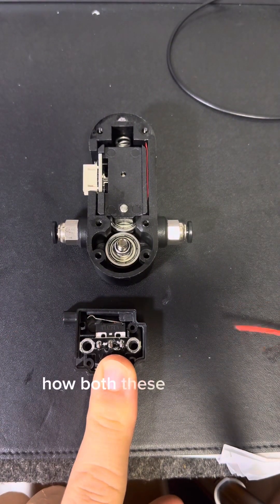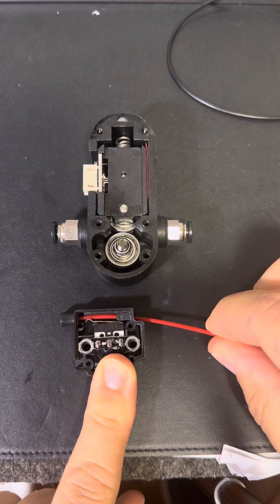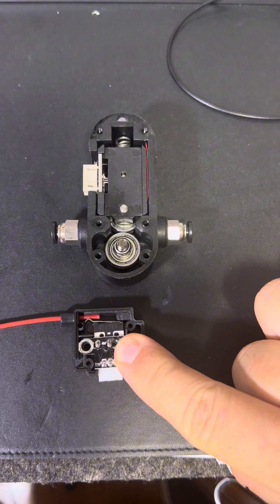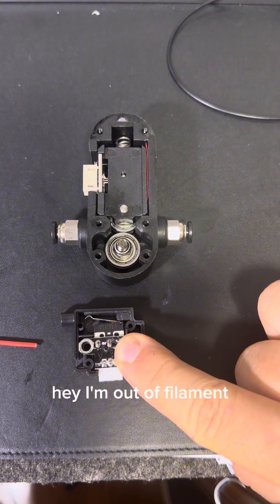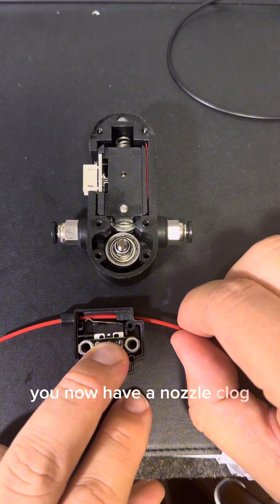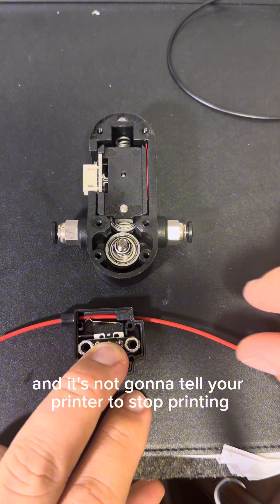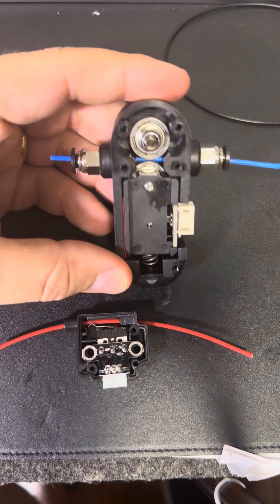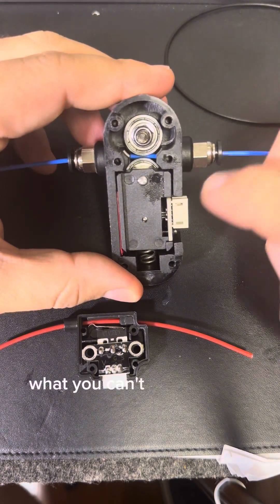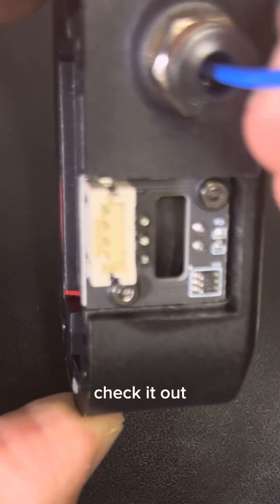Let me show you an example of how both these types of switches work. Here we have the filament runout sensor. As you can see, when you put in the filament, it turns on the switch and lets your printer know hey, I've got filament. When you pull it all the way through, that switch will turn off and let your printer know hey, I'm out of filament — stop the print. Now imagine the filament is being pulled through but instead of running out, you now have a nozzle clog. That filament is not going to move at all and the sensor is not going to know you have a nozzle clog. Now let's take a look at the smart filament sensor. When you put the filament inside, you can see it slides in between two wheel bearings. Inside this box there's actually a gear that is spinning that wheel. Check it out — see it moving?